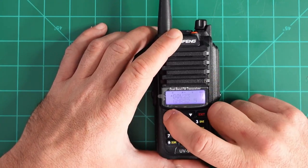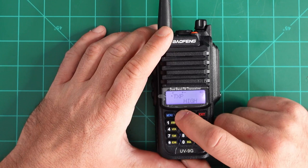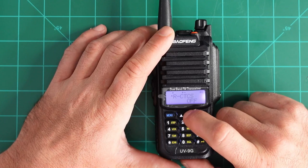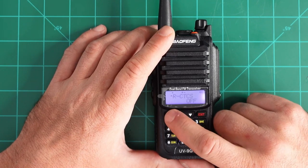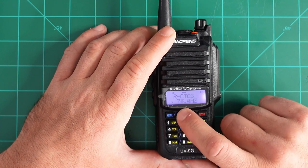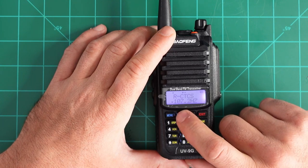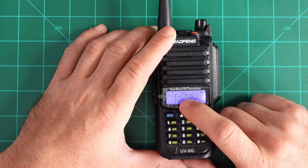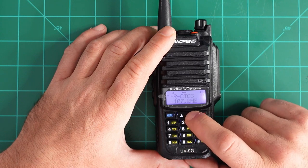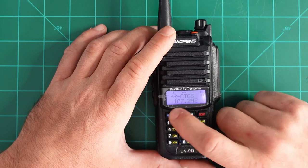Here I am, and I'm just going to use an example, do-it-yourself 23, and I go into menu. And this is your typical Baofeng menu. But what I'm going to do is I'm going to go over to, we'll just call it the receive right now. And I'm going to hit menu. And that brings me down here. And I'm going to turn that on. And I'm going to turn it to 107.2. And then I'm going to hit menu again, which saves it. And then I'm going to go ahead and see if it saved. It did save, so great. Now my do-it-yourself 23 channel has a 107.2